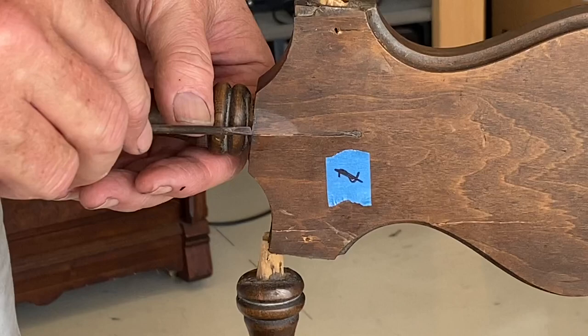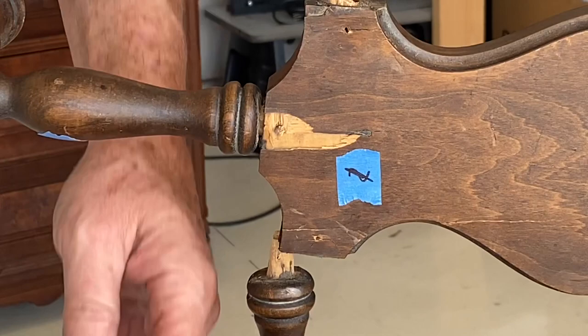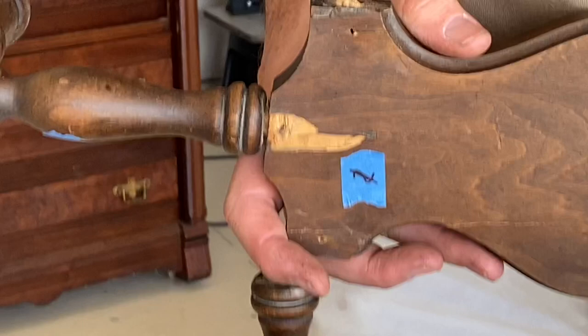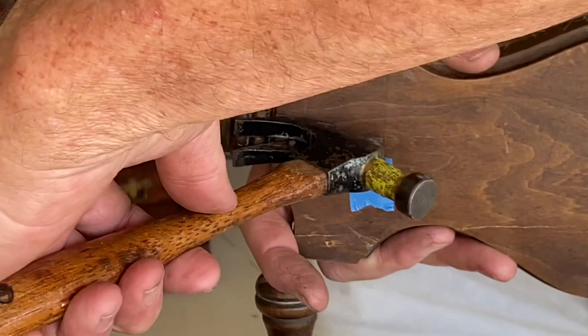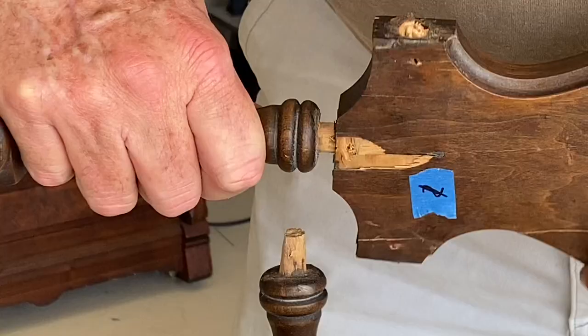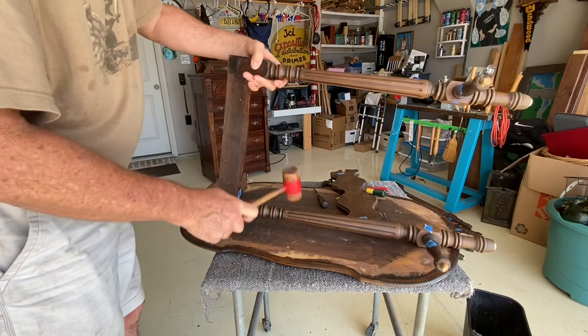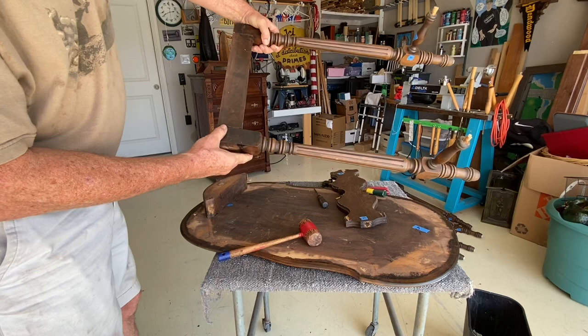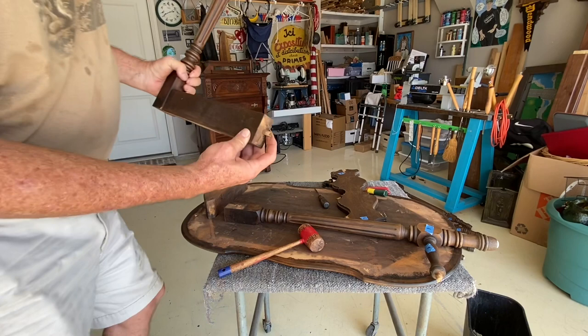Here's the veneer — I'll chip away a little piece and save it. There's the nail head, so now we can get this last nail out. I think I can use the hammer; it's very thin. I'm not sure if this nail work was done at the factory or during some later repair. Now we have the shelf out and can repair it. This one has both a dowel and a nail that's been quartered in there, so that's got to come out too — and there we go, there's that nail.